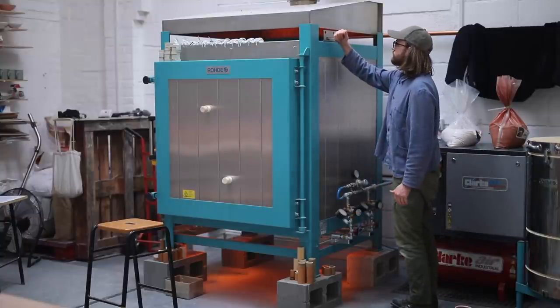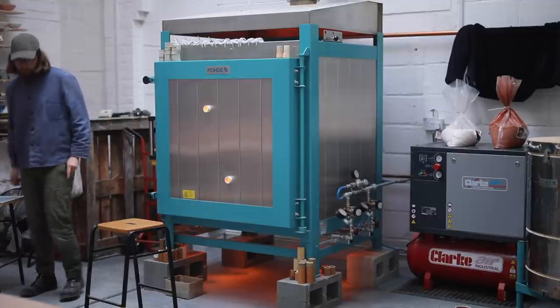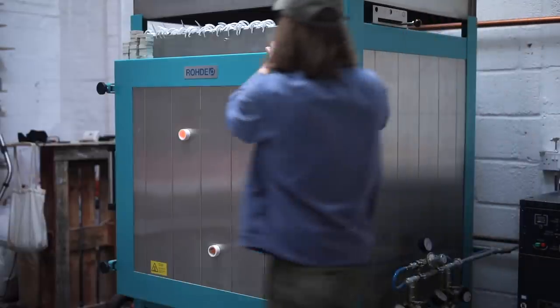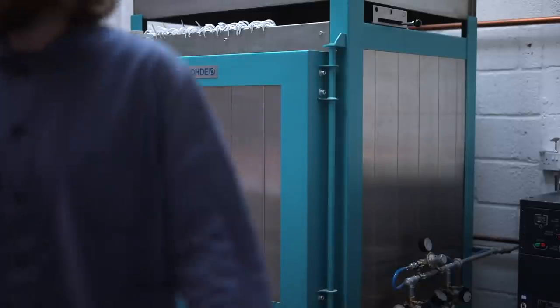But it's not quite over yet. The last thing I do is crash cool the kiln from about 1290 degrees centigrade back down to 1000 degrees centigrade. I do this by opening the damper fully and by removing the two bungs in the spy holes in the door. It doesn't take long — maybe 30 minutes or so — and it helps to retain colour in the glazes and keep them nice and shiny too. Once I'm happy with that, I close the damper fully and put the two bungs back in the spy holes. From this point onward, I can let the kiln cool down naturally, which takes probably about 36 hours or so. I do one quick double check of the gas in the burners just to make sure everything's switched off.